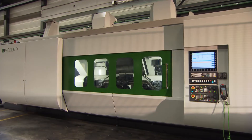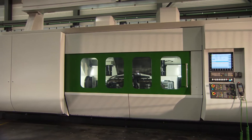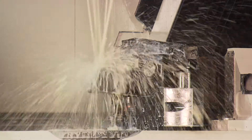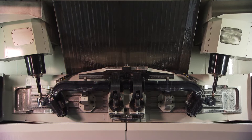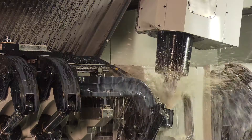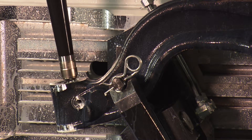This great feature allows continuous production, eliminating downtime for maintenance or tool changes. The UniTwin 6000 is highly dynamic with a very robust design, ensuring optimum cutting capabilities. The two tilting spindles in combination with the A-axis allow easy accessibility to perform all operations such as milling, drilling, boring, and reaming of kingpins, as well as milling the outer circumference of the kingpin, drilling cross holes, drilling the spring pad holes, and much more.